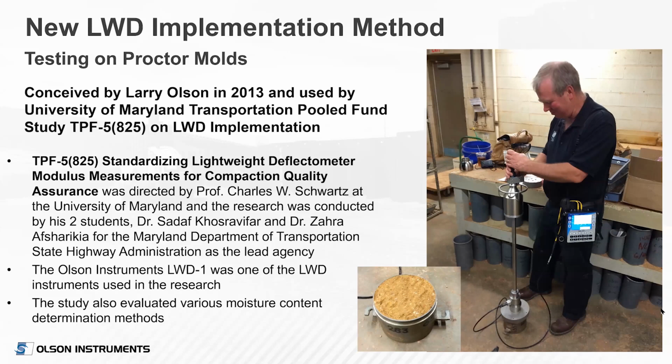So early in my career, I got bachelor's and master's in civil engineering and geotechnical from the University of Texas at Austin. And I worked locally in Denver for almost 5 years at CTL Thompson, doing geotechnical materials and pavement engineering. My first year in particular, I got the chance, as most young geotechnical engineers do, to go to the field and do quality assurance testing of the compaction of subgrade, road base, even asphalt. I used a nuclear density gauge, dug the sand cones, burned out moistures in the field, the whole bit.